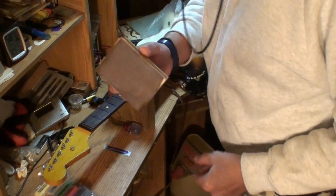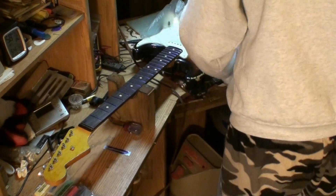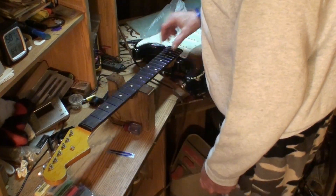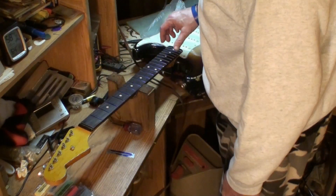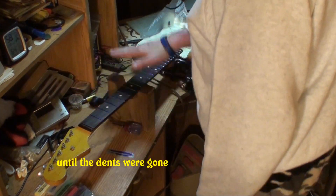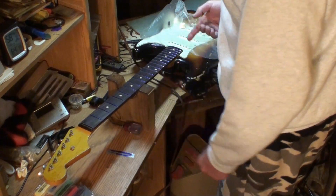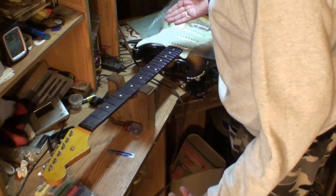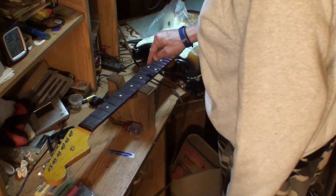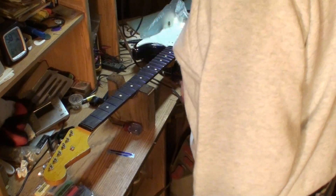Welcome back. I ended up putting some heavier paper on the block, then colored all the frets blue again, and went over it with 800-grit sandpaper until it was taking every bit of the blue off completely across. It took out the wear — there were more dents in there than I thought. The owner knew what he was talking about; I couldn't see them until I put the blue on and started rubbing it away, and I could see where the divots were because they still had blue on them — it was sunk down in.